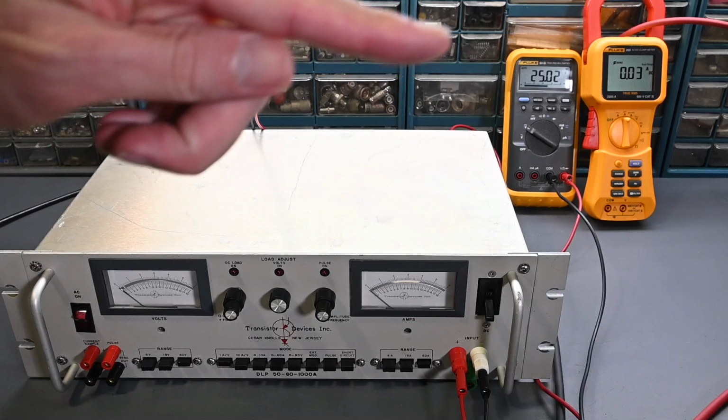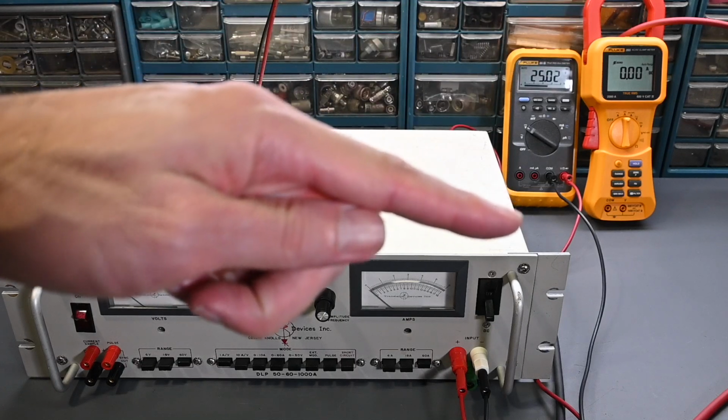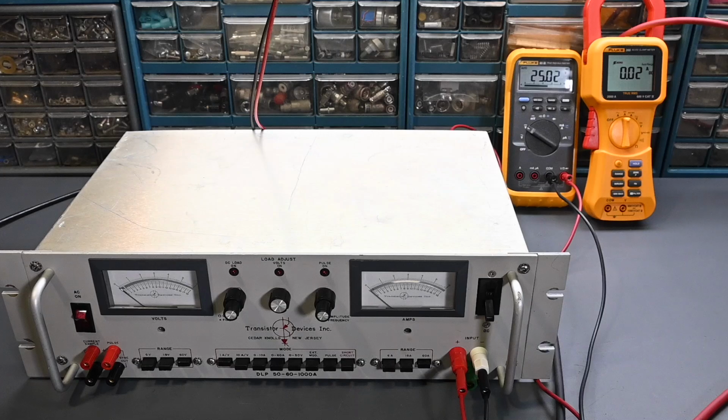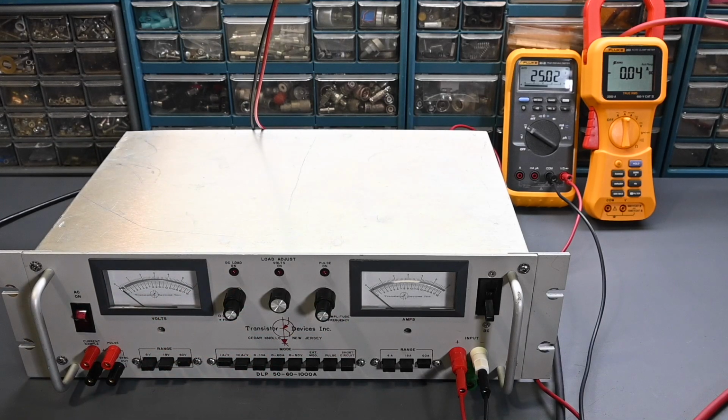So if you see up there in the corner of the frame, that very heavy gauge cable, the red wire, and there's a black cable that comes right around the corner right there. So those are leading down to the power supply. So the clamp meter right there will show the current draw, and that current draw should match this meter right here, and then the voltmeter here, when I turn the circuit breaker on, should of course match the digital multimeter that's showing the voltage. Now there'll be some voltage drop in the cables, so it'll be normal when it starts to draw heavy current to see that voltage drop down. That's not the power supply voltage dropping because it is a regulated supply. It'll hold at 25 volts.